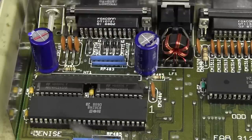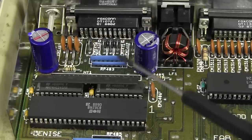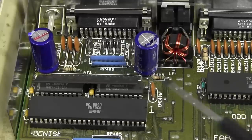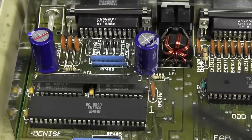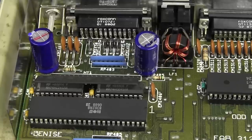Here's our first ASIC: Denise. Denise stands for Display Enabler. This is the display ASIC controller, famously capable of locking onto and syncing to external video signals. You could buy an external Genlock adapter to overlay video onto an external signal — a very popular use for the Amiga 500 in its day. Denise handles all the video timing, all the bit-planes, and the HAM (Hold and Modify) operations. Full ASIC manufactured by MOS Technology, date code 0688.